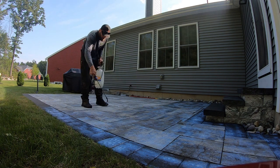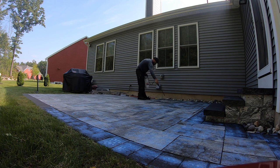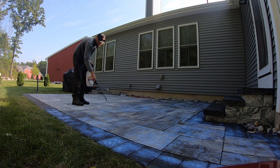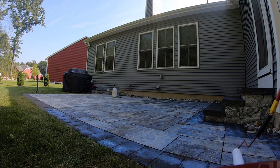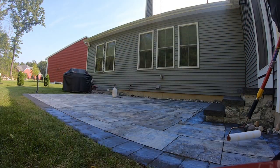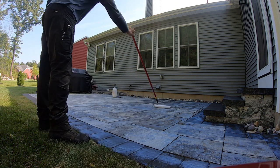This is something that's very easy to add to your toolbox. A $20 pump sprayer — as long as you keep it clean, maintain it after every job, rinse out the hose and tips — will last a long time. One gallon of SRW was about $50. This customer I quoted for two coats on this small front patio for about $600. The SRW is very comparable to Behr at about $50, so your margins are pretty good.